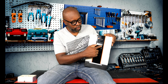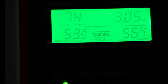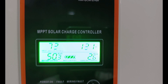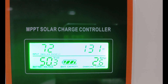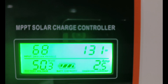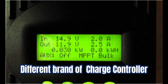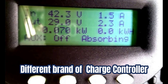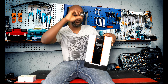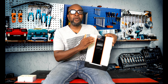One of the things I didn't like was the screen display — it's quite tiny and doesn't show me much of what's going on. For instance, I don't know when the charge controller is in bulk charging, when it's absorbing, or when it has reverted to float — which is very important. I am really a sucker for big screens that tell me exactly what's happening. But aside from the screen size, those features simply aren't there. So how I could tell when it was floating was by monitoring the set voltage I had configured — if it was still climbing to reach that voltage, I knew it was bulk charging; once it held at the absorption voltage, I knew it was absorbing.